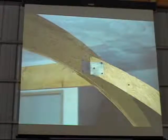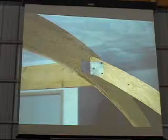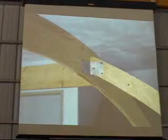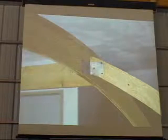How do you attach the upper parts? They have to come at a certain angle as they go along. It's a flat piece of metal that you can get at any Home Depot. You can bend it in any shape and screw it in. This takes care of the entire structural load. With just the two central arches and one side support, you can hang from it and it's perfectly sturdy. You can imagine how strong it is when all the arch supports are on it. Arches are incredibly strong — ask the Romans. They built arches 2,000 years ago and they're still standing.